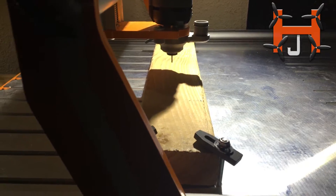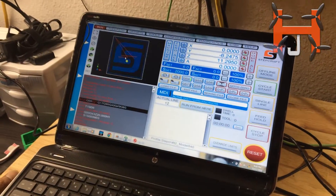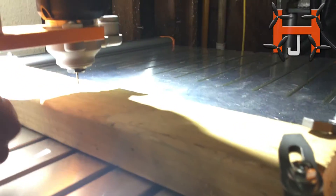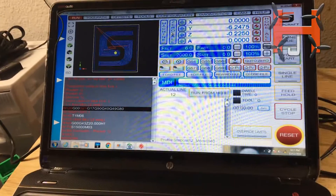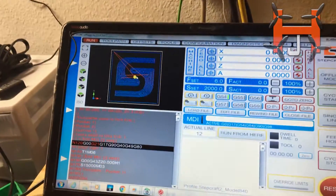Let's look at the piece of wood to make sure it's centered — right about there, that's centered right there. Alright, so now I'm going to bring it down. And what I'm going to do, I'm going to use a piece of paper that's going to allow me to see the gap. Okay, I'm comfortable with that. Alright, so that's going to be zero — right in the middle. I'm going to do zero off, and it's going to readjust the little yellow ball you saw there. Make sure my end mill is properly adjusted.